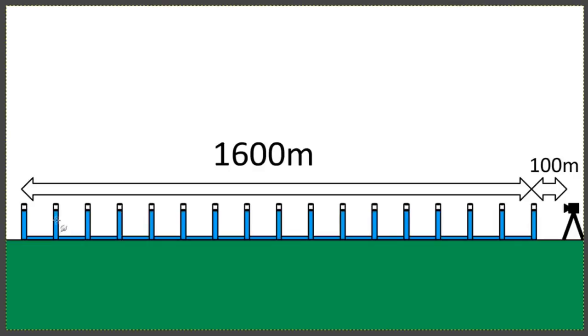clips. Now, the way he's explained it is he's going to have the marker or the light on the last pole here, or tube. It can be an arbitrary position, but it will be somewhere below the water line. So the tubes will already be filled up with water. And if at that point we actually, I don't know, put a laser or something, or found a way of showing a line of sight across the top of this water, we would find that it is in fact level, regardless of the shape of the terrain.